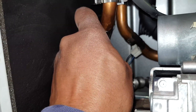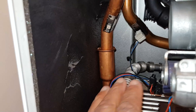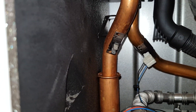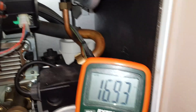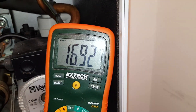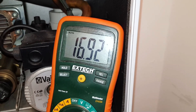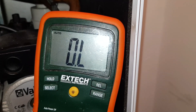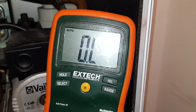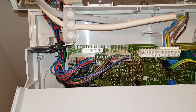Pull the plug off like that - so they're disconnected. We're going to go across them with our multimeter. On the first sensor it's about 16 to 17, so it's quite high. We'll measure the other one now - we're on the back one, the return one. That's reading about the same.